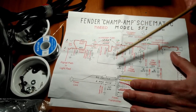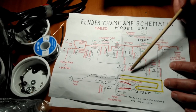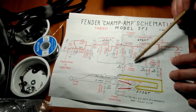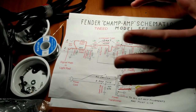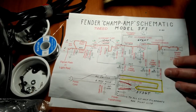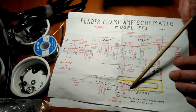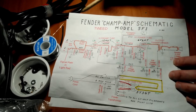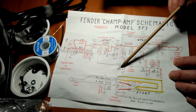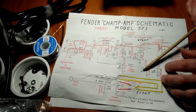There's also only a couple of types of capacitors. We have our filter caps, which we talked about, which store charge, and as the amp calls for the charge, puts a demand on the need for it, it will supply voltage to the amplifier and keep it from sagging. But it also eliminates ripple after we change the AC from the wall into DC. Because of the way a rectifier works, it's not a straight, smooth line of DC voltage. It's got ripple, it's bumpy, and these eliminate the bumps. The more filtering you have, the smoother that line is. So that's the first type.